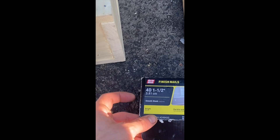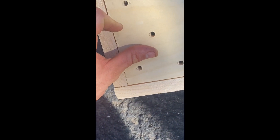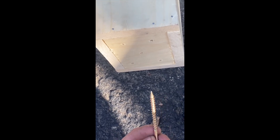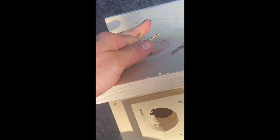As far as what you'll need: you'll need a hammer and finishing nails — these are one and a half inch thinner nails; you don't want anything too thick because it might split the wood. You'll need a half inch bit to drill holes in the bottom for drainage so that water doesn't accumulate. Then you'll need something to hang into the tree — I have three inch nails left over from a different project — and I'll drill one hole at the top of the birdhouse to hang it using this drill bit.